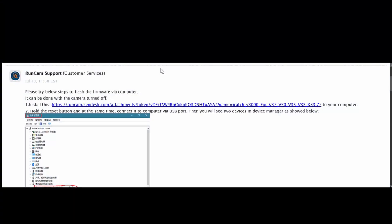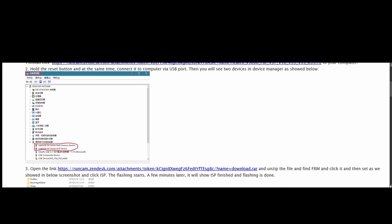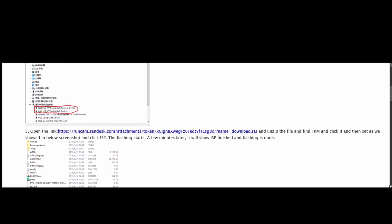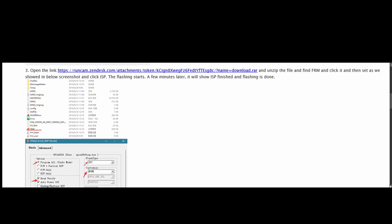What you're seeing here is an email that I received from Runcam. It is going to tell you to download a driver, and you just follow these directions on the screen — look at your device manager and make sure that your device is there. Then you're going to download another file — I'll have all the download links in the description. Run it and make sure that you have set up: program all, read, verify, auto power off, SPI in flash type, and none for customized. And it should update to the latest firmware. When I updated it wasn't the actual latest firmware, but after I did this update I was able to get the latest firmware the normal way with no problems. Everything worked fine.